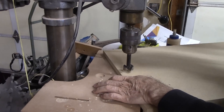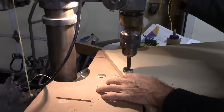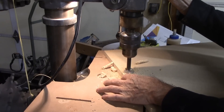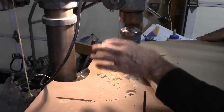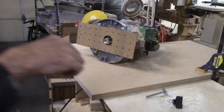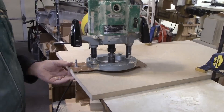The sled is ¾ inch MDF. I found a piece wide enough and much longer than I needed, but I did not cut it to size — the reason will be apparent when I use the router bits. First, I need to drill a shallow recess for the elevator bolt head, 1⅛ inch diameter and about 3/16 inch deep. Then drill the pivot hole at ¼ inch diameter completely through the MDF.